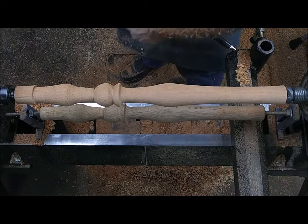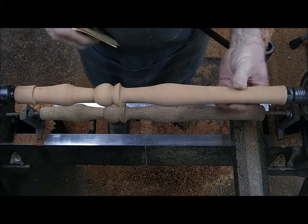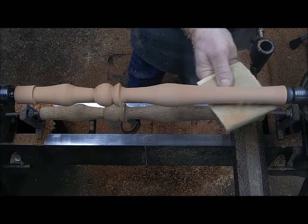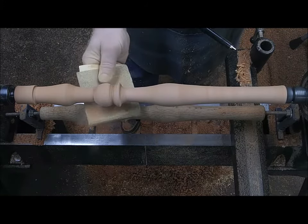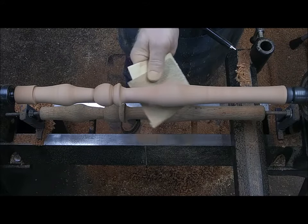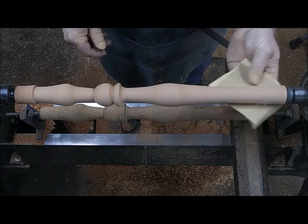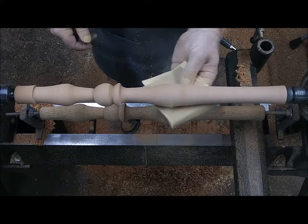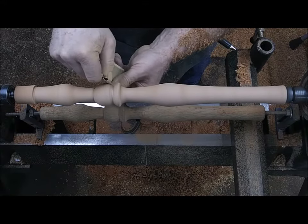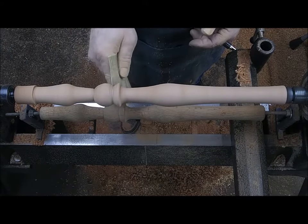Got some 100 grit here — no, that's way too coarse. Here we go, yeah, that's sweet. It's a pretty long piece, so I'm probably going to want to slow this down a little bit. I'll do that tenon end in a minute, but I want to show you what it's going to take to get it halfway deep to finish on this. Going real light here — you just really want to touch this — and I'm going to load the paper up.